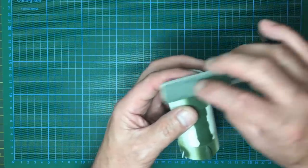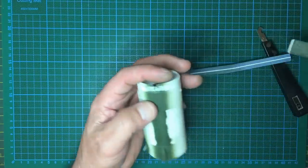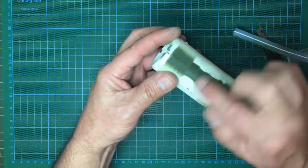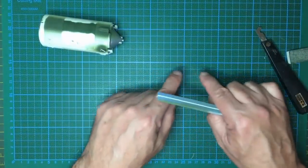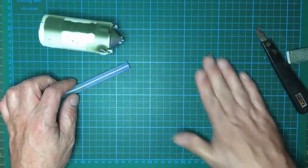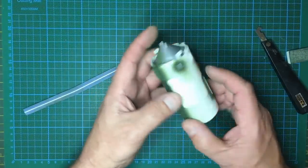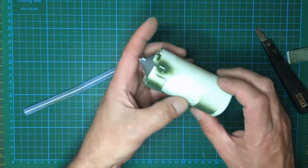And remember, like I was saying to you before, you need to be careful of using soft sponges on areas where you've got filler or raised portions, because the soft sponge will just give you a softened edge. If you've got a lump on the bench, imagine getting a hard wooden block with sandpaper and sanding away, you would sand that lump away till it's flat. If you use something soft, you would basically sand that lump into a slightly raised area. So you need something hard to get down and get everything level,